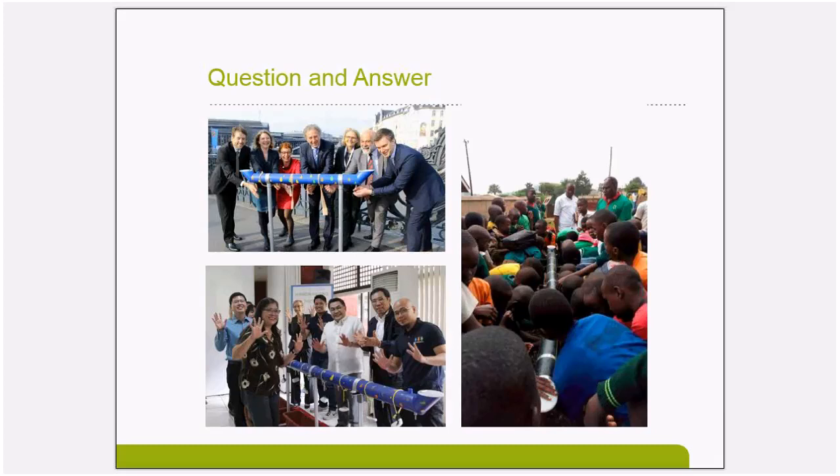With regards to the experience and the cleaning, going to your point on algae accumulation, on the first 10 schools that we piloted the WASHaLOT, algae accumulation really depends on two factors: exposure to sunlight and the source of water itself. We do encounter schools that have pretty bad algae accumulation in the water in their WASHaLOT, and we recommended to use a brush. A brush attached to a long flexible rod, so you can push and pull it from the water inlet to clean it.